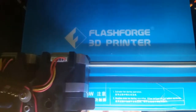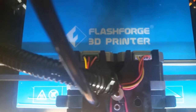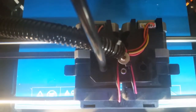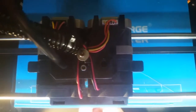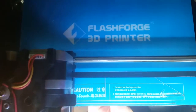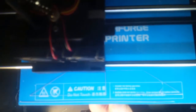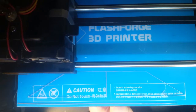I keep letting this take place and keep adjusting manually at the bottom as the print actually occurs. By having a print slowly take place with two layers, I have plenty of time to adjust each axis until I'm satisfied. Another thing I like to do is slow down the print speed while adjusting, giving me plenty of time to play with the bed while the print takes place.